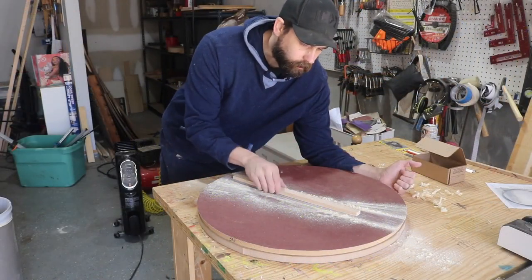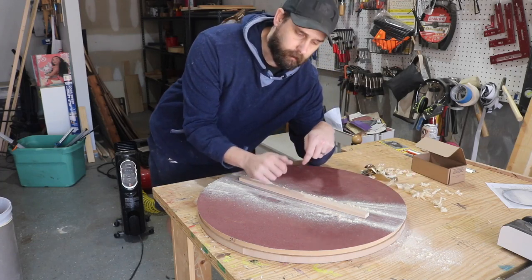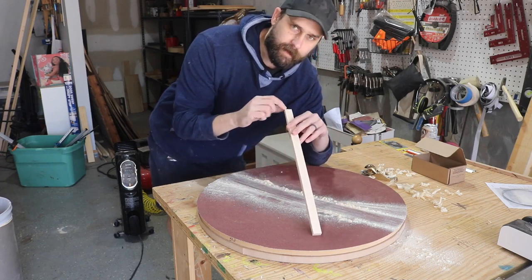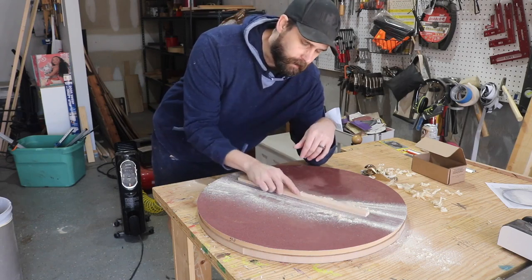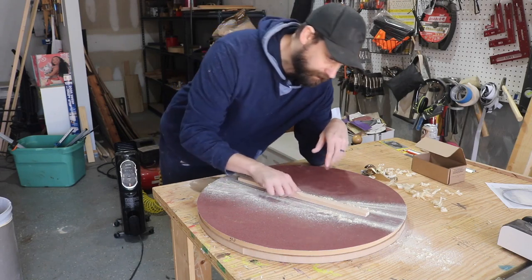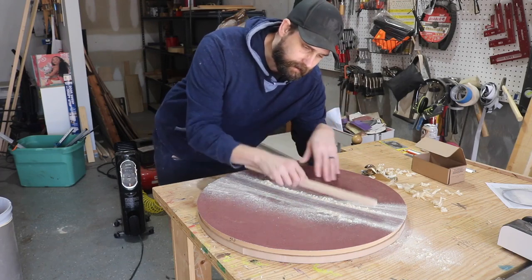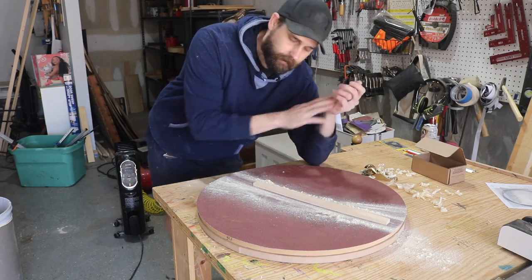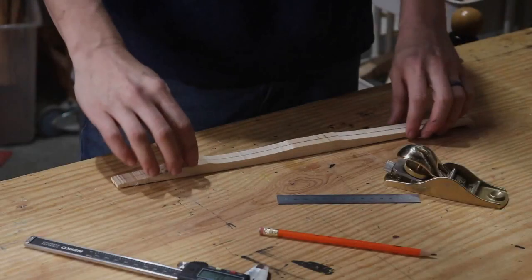One thing I already found I was doing wrong: when I was sanding, I was pushing more on my thumb than on my fingers, so when I picked it up I realized I had sanded basically a slope into it - it was thicker on one side than the other. Once I got it evened back out, I would go a little ways one direction and then switch around, which helped me keep the same thickness all the way across.